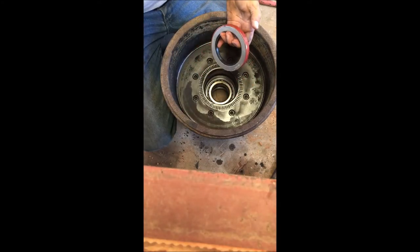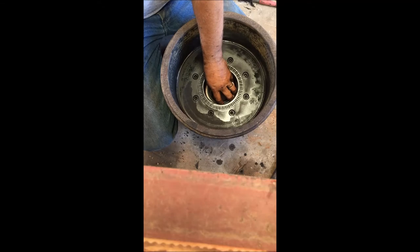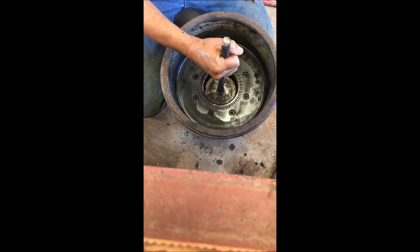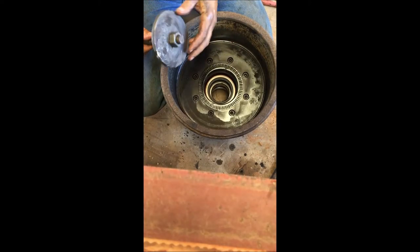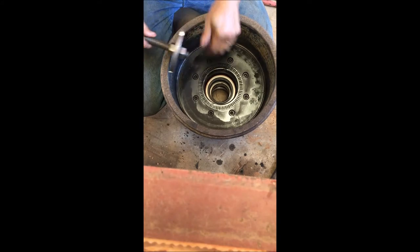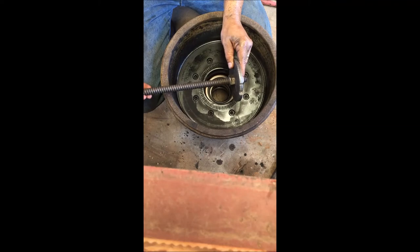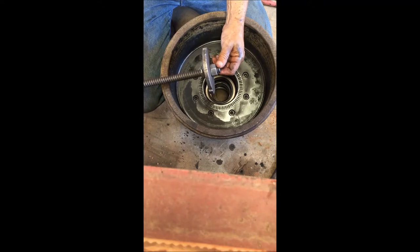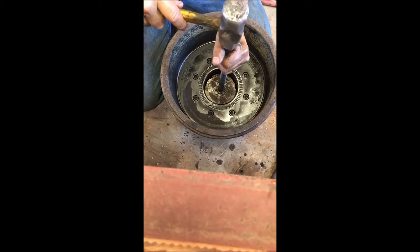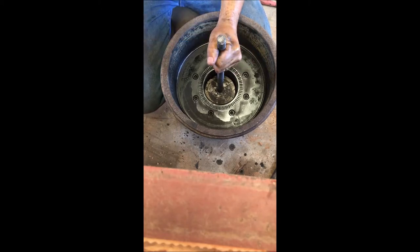The red coating is supposed to seal everything, but the important thing with these seals — and I have tried hammering them in without a plate — is that when they bend a little bit they don't work. No matter how careful you are. This is a piece of steel plate that I machined with my antique lathe. I'm not really a machinist and it's been notched for a couple other uses, but it fits the seal pretty well. Then this threaded rod — I buy it at the concrete supply place, it's called coil thread. It's super strong; you can use it for pullers or for stuff like this. You can get it in different sizes. With this rod you'll feel it if it starts to go a little crooked and you can correct it.